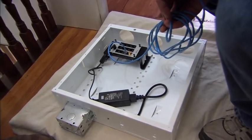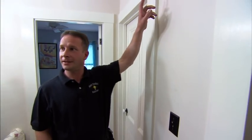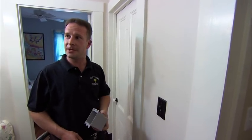A home run is a direct shot from the module to the basement unit — that's correct. Now to install this unit, we're going to run the wire up into the attic, down the chimney chase to the basement where our central termination point is. So up and over is easiest for us. I've already drilled a hole down into this wall to determine that it is a hollow space we can get into.